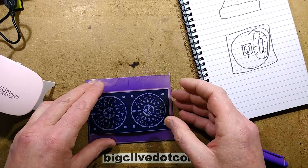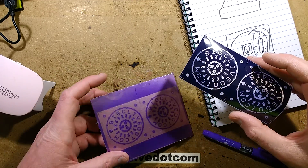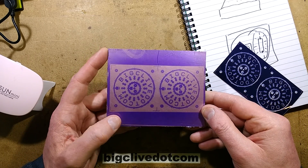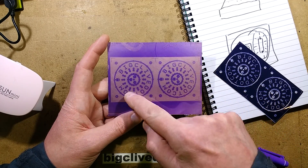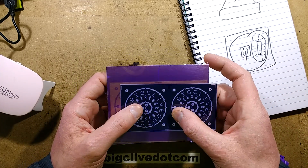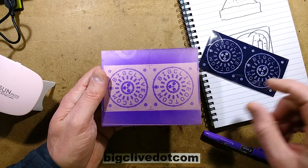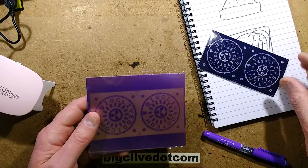Was one minute long enough? It's fuzzy because it hasn't been pressed down tight enough, but that shows it's quite a good exposure. I'd concentrate it more towards the middle area, and really sandwich it down tight to get a good mating. But it's quite usable for exposing ultraviolet circuit board material.